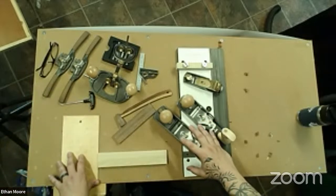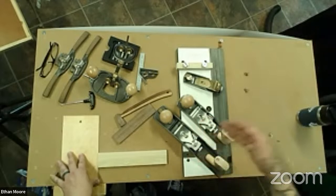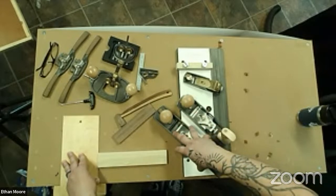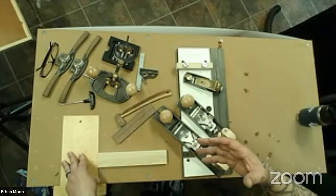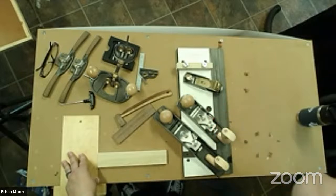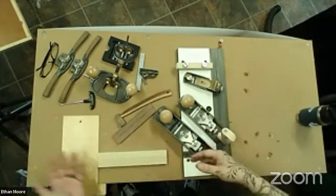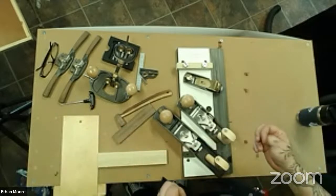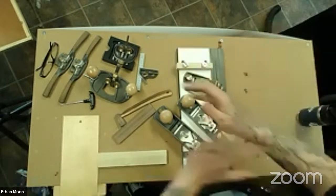A jack plane is known as the jack of all trades — that's how it got its nickname. It's basically long enough that it can flatten boards quite wide. I can flatten a board that's 20 inches wide with a jack plane. Where does this come into play? A lot of us have a 13- or 12-inch thickness planer, but we don't have a 12- or 13-inch jointer. If you know about milling wood, you've got to start with a flat surface and a true edge, then you can go on to the other machines. If you stick a board that hasn't been jointed through the thickness planer, it's still going to be out of flat — it's just going to be thinner.